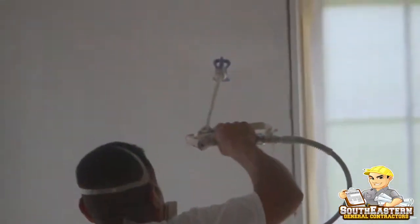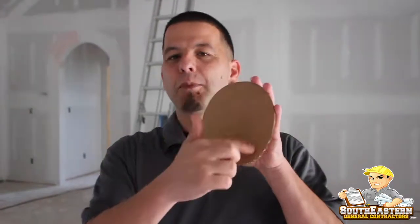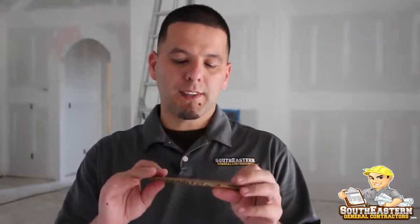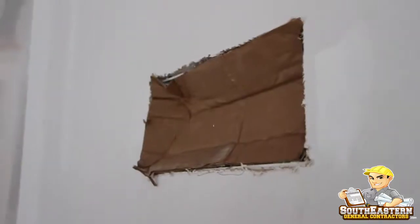The first thing I'm going to show you is when walking through, I see the painters have implemented one of the strategies and have already completed this step in our checkoff list. In the prep work, besides covering up the windows and doing the normal things, we also have them use cardboard to make a template for the can lights and for the exhaust fans. I'm labeling this a smart prep tip. As you look above, you'll see where they've placed these inside where the recessed can lights are, and they use it for the exhaust fans as well.